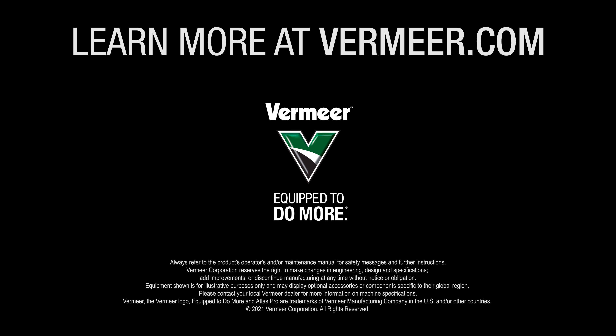You'll see that even after we've plugged the power harness into the back of the monitor and it has come on, it will not go to the home screen until we've plugged the baler harness into the monitor. We've got the cable coming from the baler and the cable coming from the monitor. These two ends plug together — there is a slot on the end from the monitor and a groove on the end from the baler that match up. We line those two up and twist the collar until it locks in place, and now we're connected.